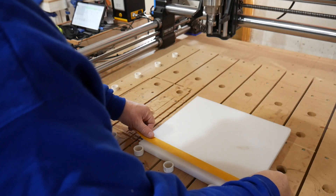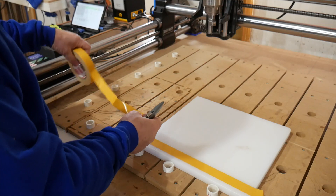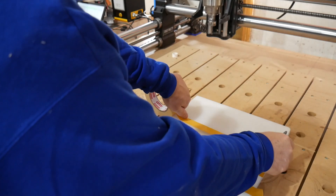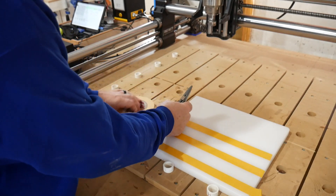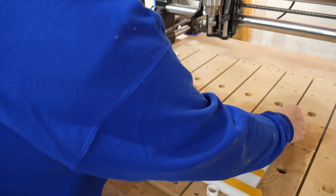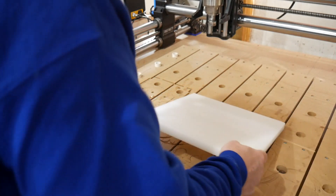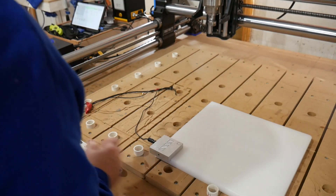I'm not a big fan of two-sided tape, but I need access to the entire surface because we're going to machine down the outside corners to make a position or a spot for hold-downs for the vacuum. I'm going to stop calling this thing a puck because that sounds too close to another word — let me know in the comments if you can come up with a better name. Let's stick it down and see what we can do — we're going to zero off the corner with the touch block.